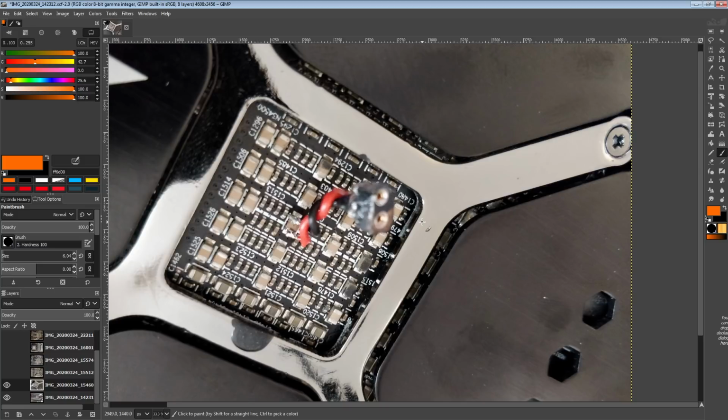And I can't float the oscilloscope either. I've tried both of those, and floating either of them causes massive issues. The only active probe I have is really low bandwidth and kind of noisy, and I don't really want to use it because the resolution problems of my oscilloscope with the active probe are even worse. So unfortunately we have measurements that are off in voltage by some amount, but it's consistent, so I'm fine with it.